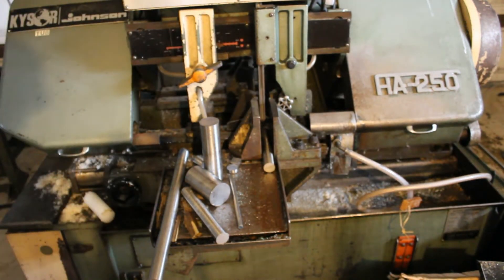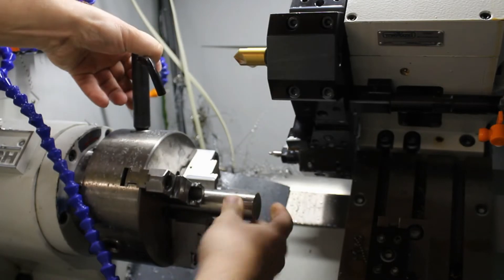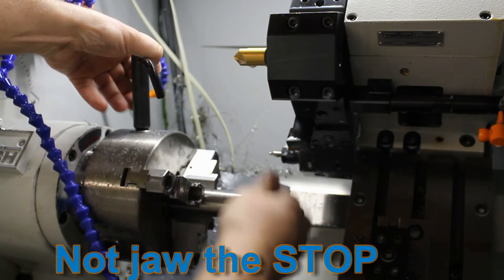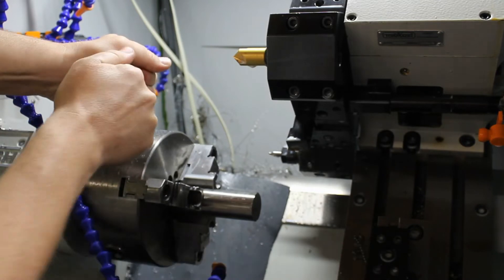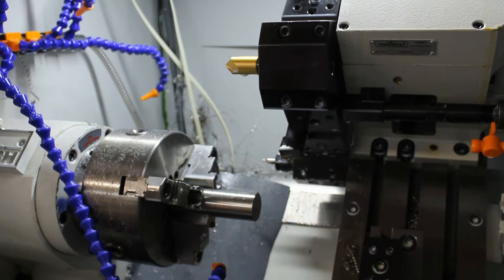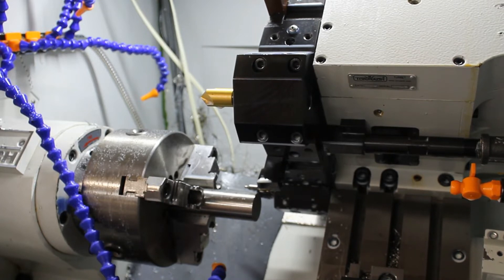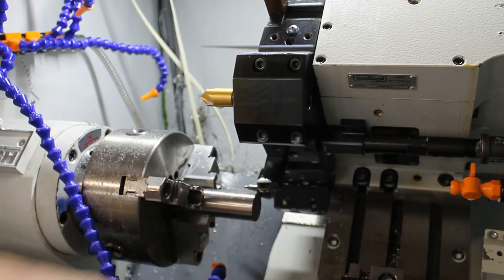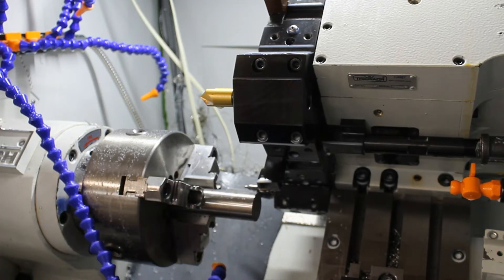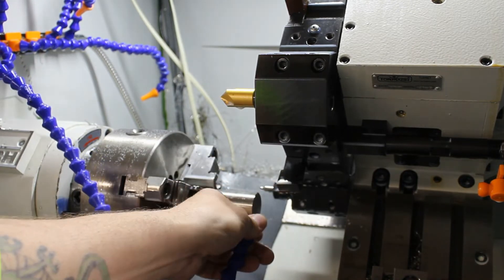Big parts, big bar and a little bar — push till it hits the back of the jaw. That's how I have my Z zero set. Just need to set the Z on the only tool this part uses, which is tool eight. It just cuts off a little bit to clean the face up, set my zero, and we should be ready to go.